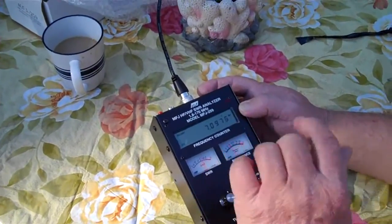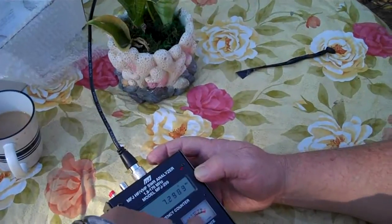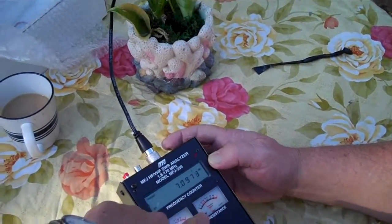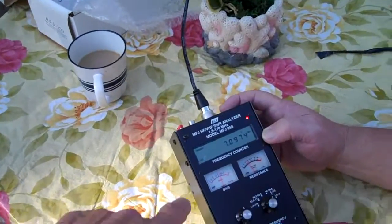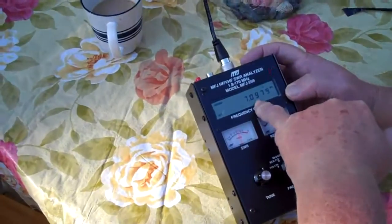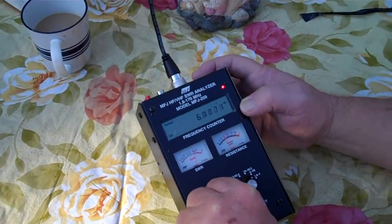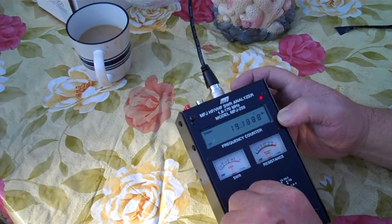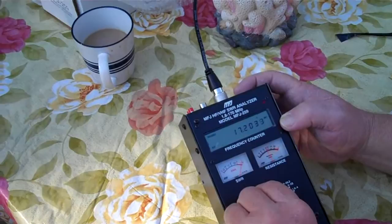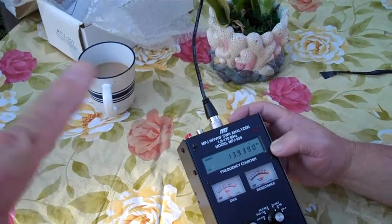This cable will eventually be connected into an antenna tuner, and anything a little wacky on the antenna resistance can be tuned out. Because the antenna tuner doesn't really tune the antenna — it just fools the radio into thinking it's facing a 50-ohm load. Now on 40 meters, somewhere around 7.1 megahertz is the lowest SWR, so the antenna is doing what it's supposed to do. But it does look like some trimming may be needed — I'd try six inches off each side to start.